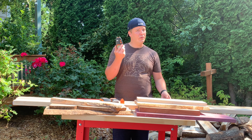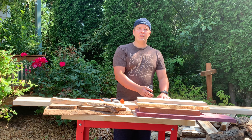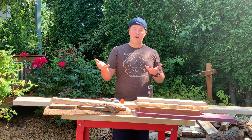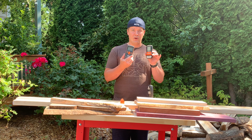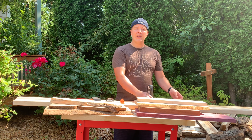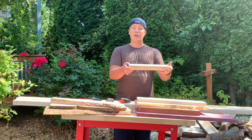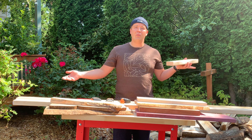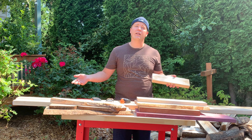Early on I got myself a moisture meter — this one about three years ago, the Dr. Meter moisture meter. You just stick the prongs in and it gives you a reading: the percentage of moisture content. That's a number to start with. There are a lot of different species and variables with these units. Dr. Meter sent me some of their new ones to test out, but with any of them it gives you a number. For example, a 2x4 from Home Depot — it looks dry but still has a high moisture content, maybe around 20%.